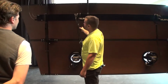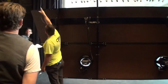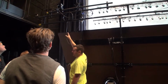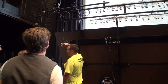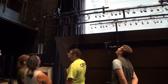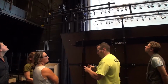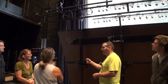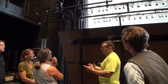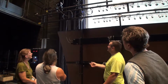As far as the electrical concerns go, you want to be careful of that cord right there. That's an electrical cable, and it's on a reel up there. So you don't want to hang anything off it or catch anything on it. If you see it slacking, that means something happened to the reel upstairs. They took the brake off the reel, the ratcheting device, because most reels have one: you pull it down and it stops, then you pull it again and it goes back up. We have to take those off when you use them like this, otherwise it would just dangle. It would be bad.